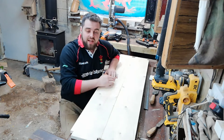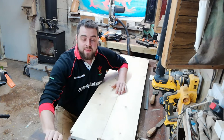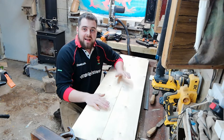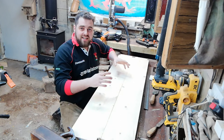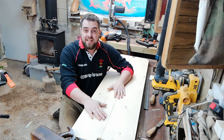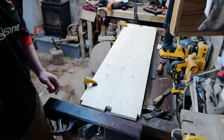I've just peeled the wax off with my fingernails and I'm ready to plane the seam using my old antique plane, to get the boards nice and level. The next exciting step is to draw a nice free-flowing curved line along the top, get a router and cut out to half the depth of this board, then do a little bit of resin casting — mixing in blue pigment and resin casting this backboard. There's a guy called Johnny Brook on YouTube with a fantastic channel called Crafted Workshop who has inspired me to do this style of headboard. Next step: planing and routing.